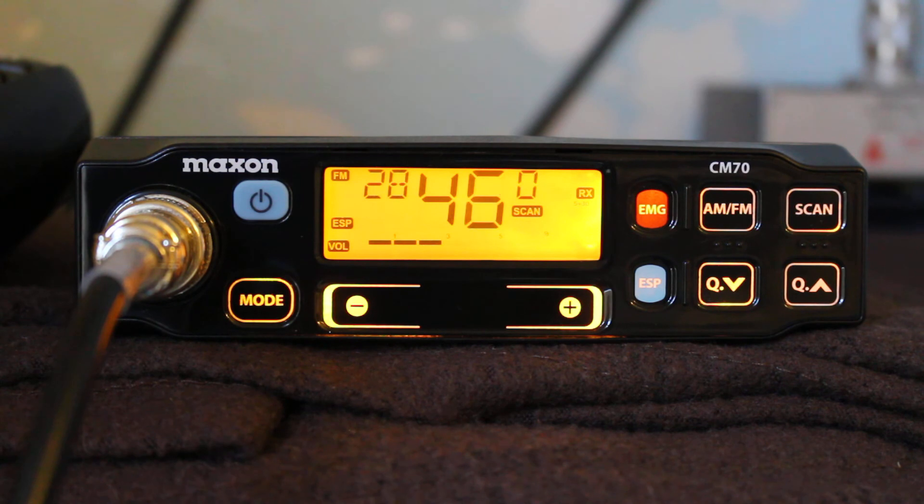So that basically is the radio. Not sure there's much else to say about it, but very good value for money. I've tested it — it's putting out 4 watts on 27 megahertz on the CB bands, and a little bit less, about three and a half watts, up on 29 megs, but that's not to be complained about. It's working well. There are still a few of these around — Knight's have them for 50 pounds plus carriage, which is seven pounds 50. The Maxon CM70.